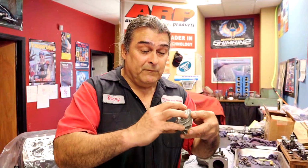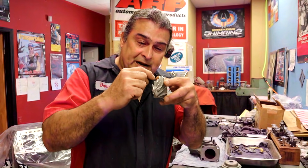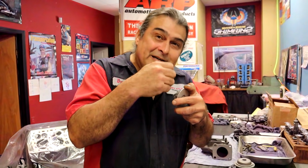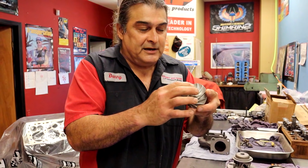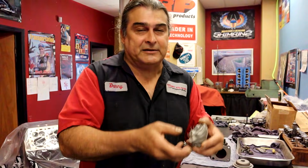Even if you see where they did touch a little more and it put a burr on them, you can actually feel a burr because it rubbed a little bit. Leave the burr alone. Don't sit there and try to deburr them. Are you going to rebalance it? No. You need that material on there. Leave it alone. Walk away. Good thing you said that. I'd rather have the little burr. The little burr is not going to be as slick for the air to turn it. It makes a little bit of turbulence.